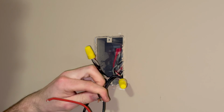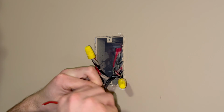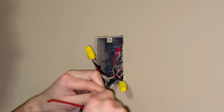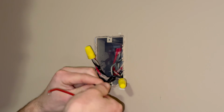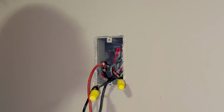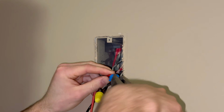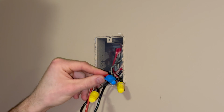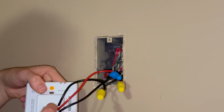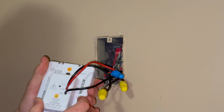And then this will be our line 1 right here. And usually if it was a normal thermostat, that is all you need to do because it doesn't need the other leg. Only reason it does is to power the unit because it needs power to operate because it's electronic. So then line 2 will go to this guy, which I'm not reusing that crap. Your line 1 and line 2 is not specific though, as it's just 240 volt, there is no difference.